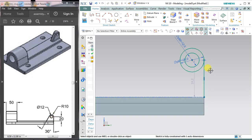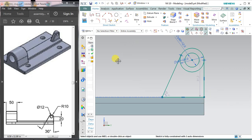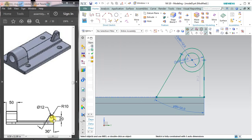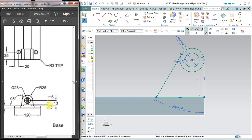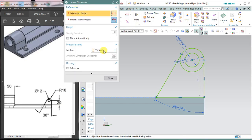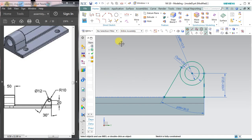Select the line again and draw a tapered line to complete your geometry. It is asking for a degree, so select angular dimension. Select this tapered line and vertical line and place a 30-degree dimension. The total height is 20 mm — as in the previous step, this dimension is a misprint but it is also 20 mm in length. Select linear dimension and select the vertical option. This is the point and this is the line I'm selecting for assigning 20 mm length. Now trim the bigger circle to make the geometry closed.